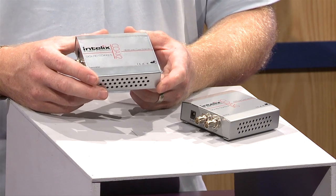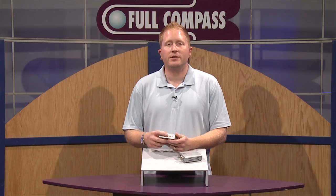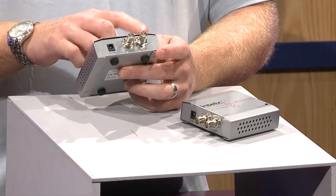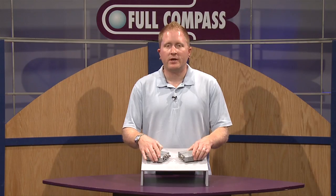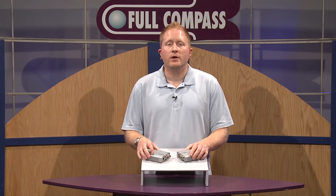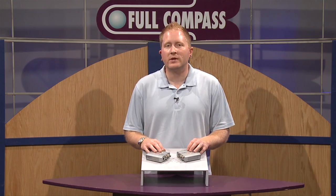The Digi HD Coax 2 is our second generation of coax extenders. This will allow you to take an HDMI signal in and distribute it out via coax. The output section actually has two output legs, so there's a 1 by 2 DA built into the unit, and the receivers have an in and an out for daisy chaining multiple units together. You can daisy chain up to 7 receivers off of each output leg for a total of 14 in a system.